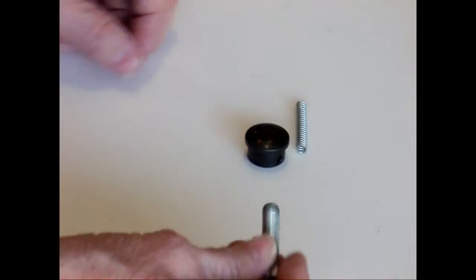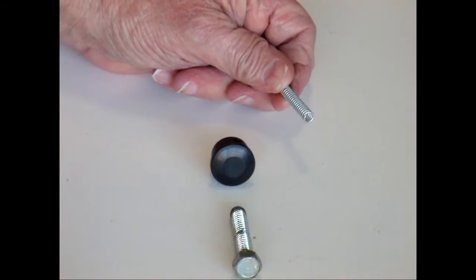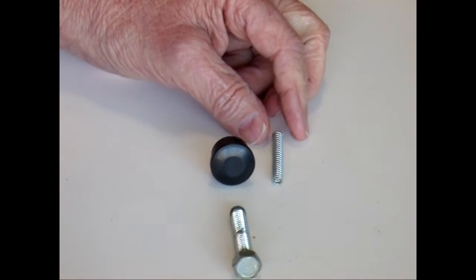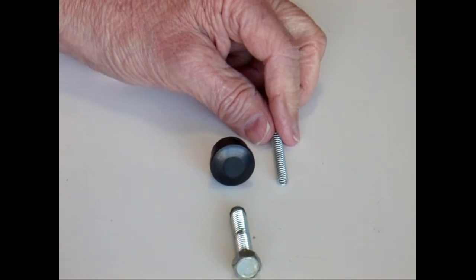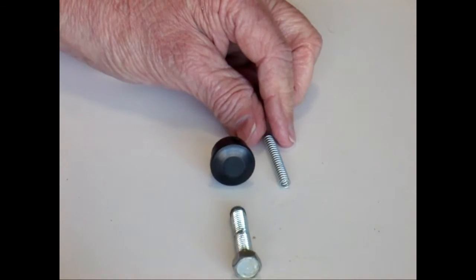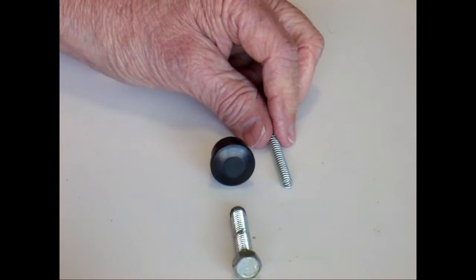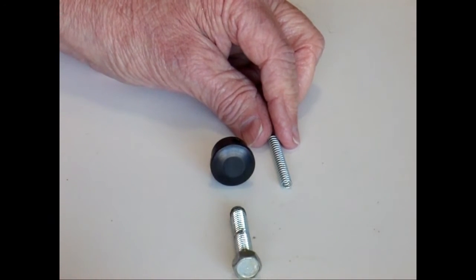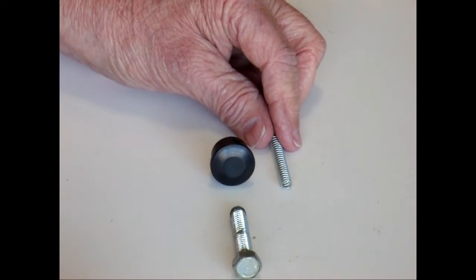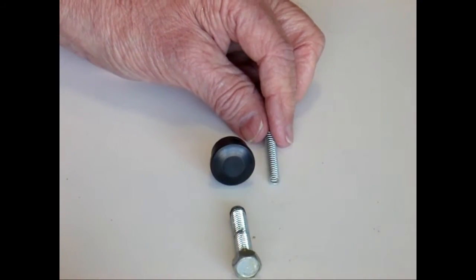If we screw the bolt back, we can decrease that spring tension on the hammer spring. This will cause the valve to open slower and not as far. This will decrease the amount of CO2 that comes out of the valve and into the breech and then pushes the pellet down the barrel. It will allow you to get more shots out of a CO2 cartridge, but the velocity, the foot per second, will be less because of that.